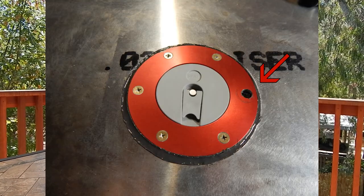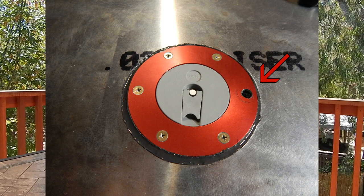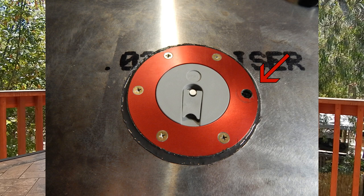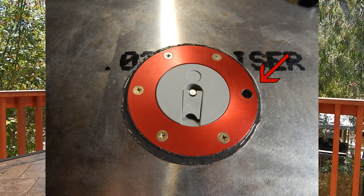Now what you've got to remember is that the tank hole is not drilled, but your tank assembly is put together. The tank assembly includes the ring on the top sandwiched with the tank in the middle, and then that support flange on the bottom. That whole thing is clamped together, screwed, and pro-sealed, but you've got the plastic tank sitting undrilled, with the hole in the cap ring top and the flange.